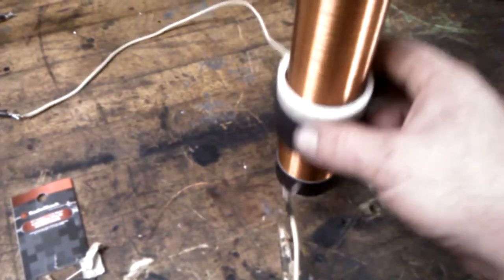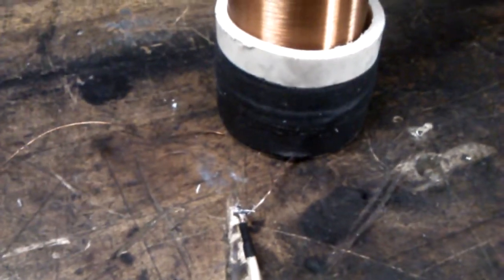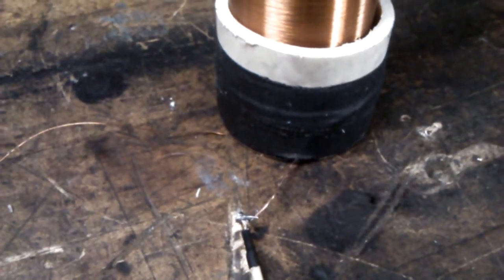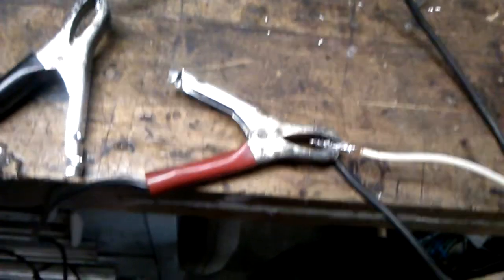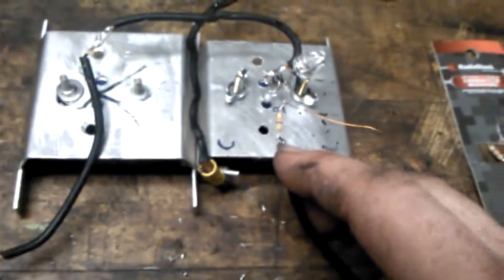The primary here is kind of loose — I like to play around with the height of it to find the sweet spot. It has roughly four turns of 22 gauge copper magnet wire. The top lead goes to your positive coming in, and the other black lead goes to a 47K half-watt carbon film resistor, which goes to the base pin of a 2N3055 transistor.